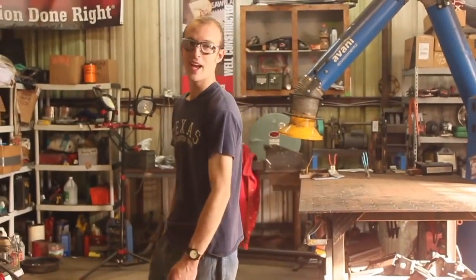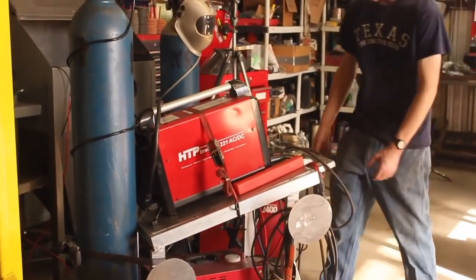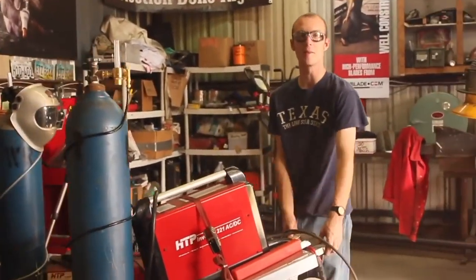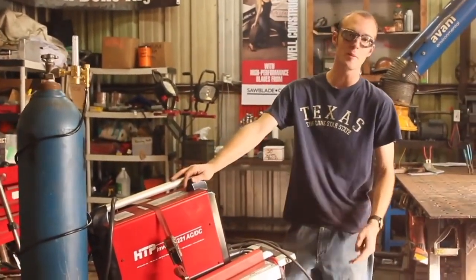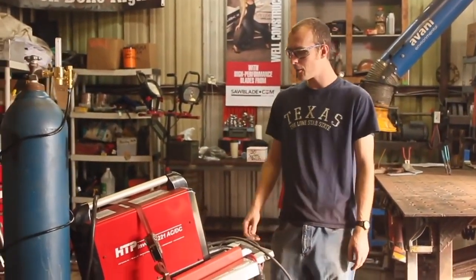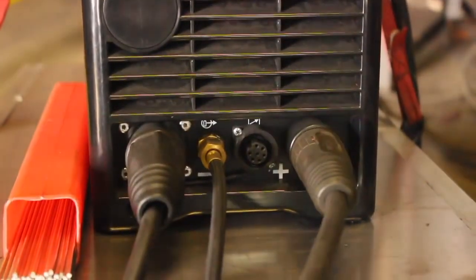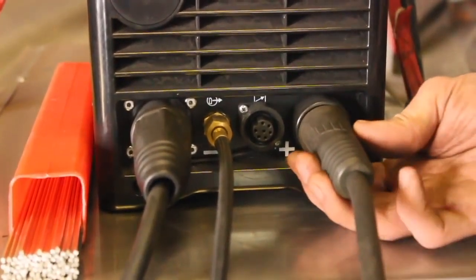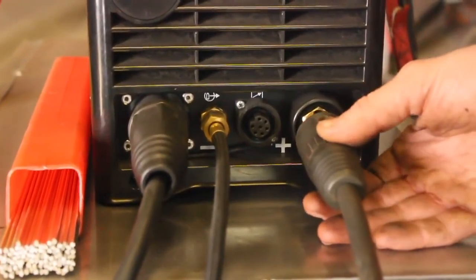Alright YouTube, it is finally, at long last, time for us to shoot a 221 video. So we'll get this machine out here and get it set up. I'll show you some of the controls and the general layout of it. We're going to TIG weld with this thing — some steel and some aluminum — and some stick welding, just in general putting it through its paces. Since we're going to start off TIG welding, I guess the first thing to do is remove its stick leads because the last thing I did with this was run stick. That's its whole other separate video — if anybody's interested, feel free to check that out.